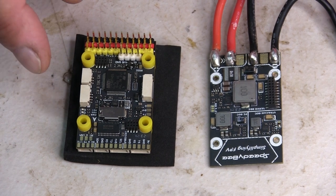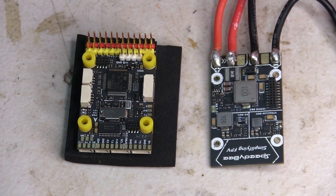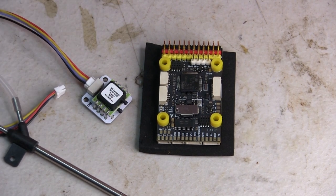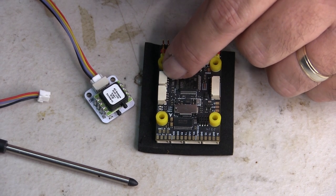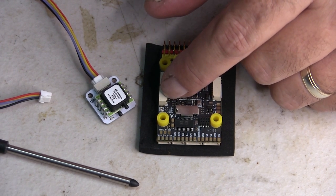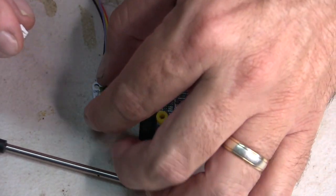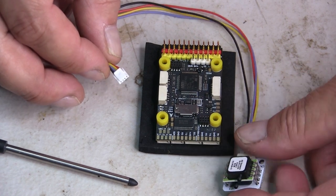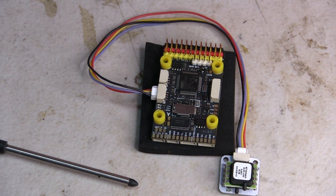Other than that, I might just adjust a couple of things there — everything else is ready to plug in for my ESC and two servos. SD card I'll put in there so I don't have to take that out at the moment, and we're pretty much ready to get all our wiring sorted out here because it's plug and play — just a matter of connecting the right wire to the matching wire in the plane for things like the GPS, airspeed sensor, VTX, and camera. This is a digital airspeed sensor, so I'm thinking I might put the digital airspeed sensor on the FX-61 instead of the analog one which is currently on there. This I2C port here is for the analog, and this one here is for the digital airspeed sensor — so depending on which one you're using, you plug into the respective port. The good thing is I don't have to do any wiring.